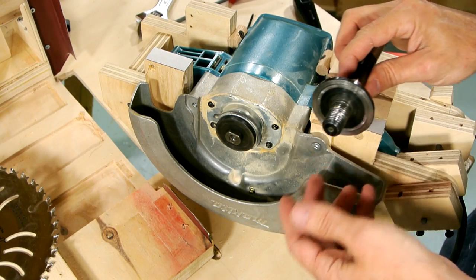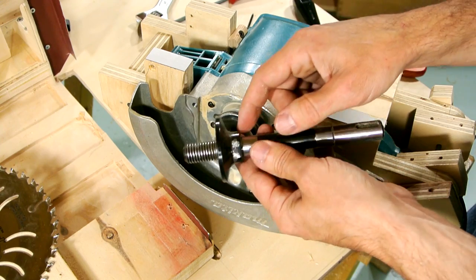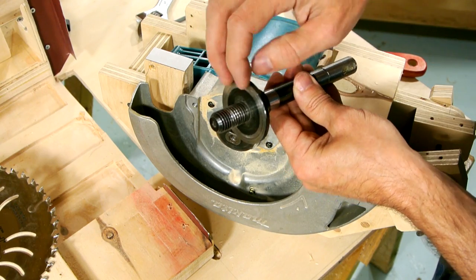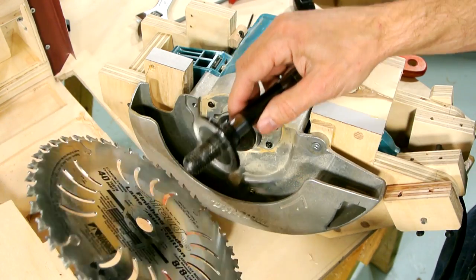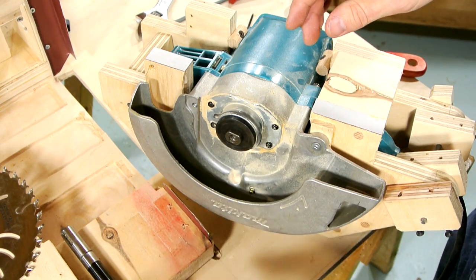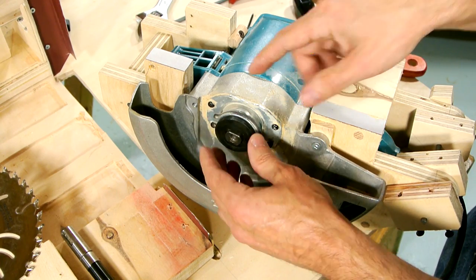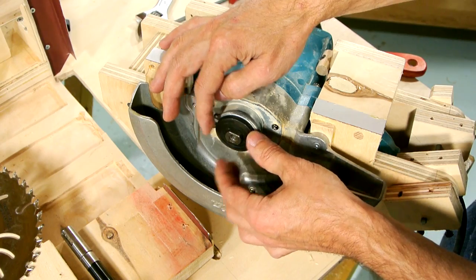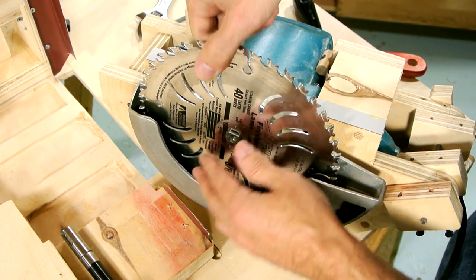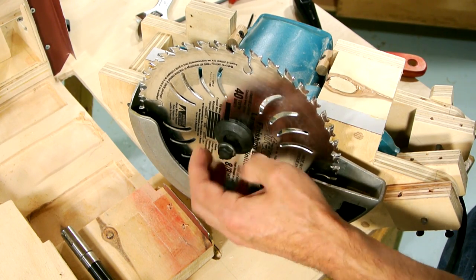Here's a word of caution about building your own table saw out of a circular saw. On any table saw of decent quality, there's a relatively large arbor flange that is press fit onto the shaft, forming a really rigid connection with the arbor that won't wobble — giving a lot of support for the blade. On most handheld circular saws and really cheap table saws, the arbor flange is just a piece that loosely fits onto the shaft, pushed against the shoulder. That doesn't provide a very stable support for the blade, so no matter how precisely you make the mechanism, it will never be as good as even a moderate quality table saw.